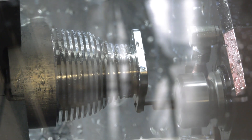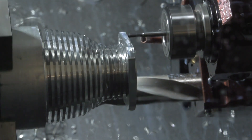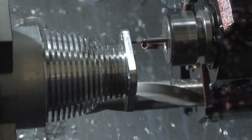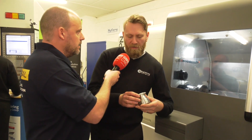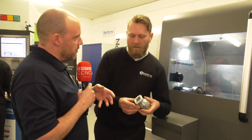You don't have half indexing but you do have 15 full stations. Also, the Y-axis dimension — for a small machine they're quite big, over 80mm I believe? That's right. It does have quite an impressive Y-axis travel, and it allows you to hit all around that square, which is useful. The long bed version gives you obviously much more working length.